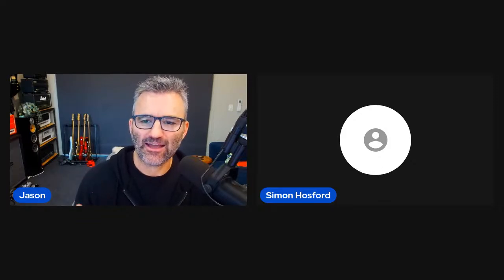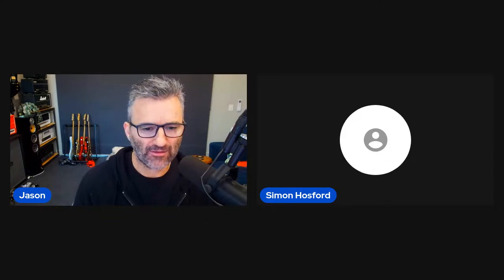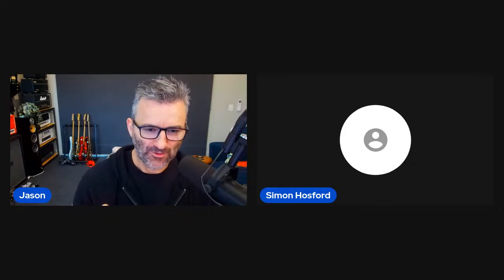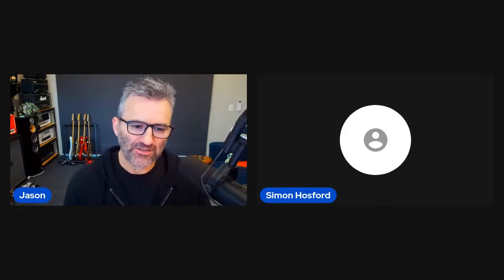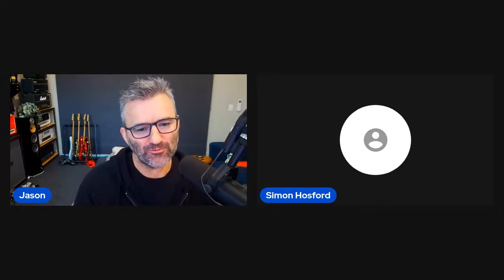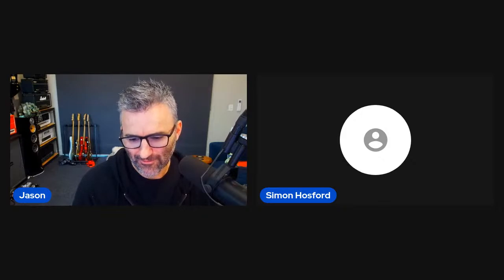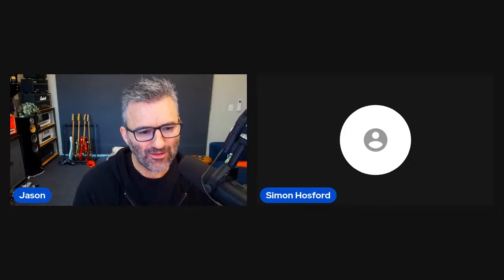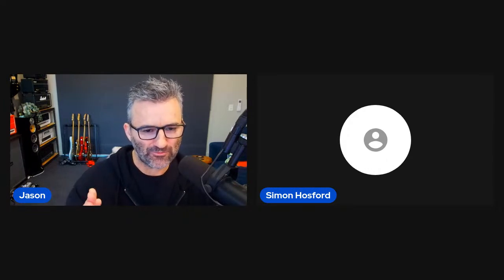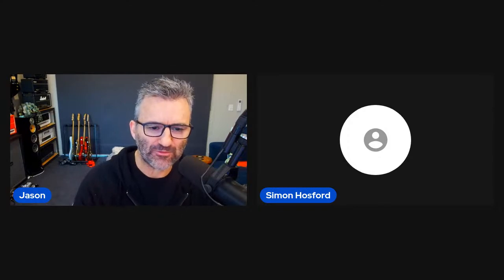And the gain on channel 3 was back a bit, at around 4, which again, when you've got the bright functions in and you bring the gain back on an amp like this, similar to bright caps on the old Marshalls, the amp does thin out a bit in terms of the bottom end. So if you bring the gain up while you've got those bright caps in, you'll hear it start to fill out in the bottom end.